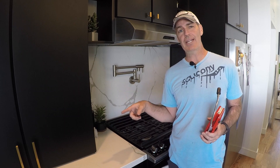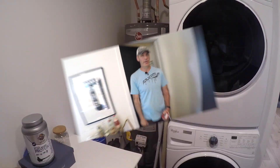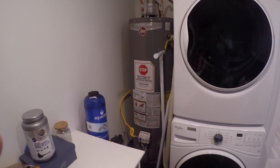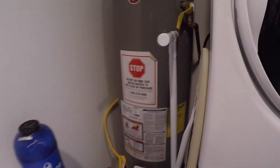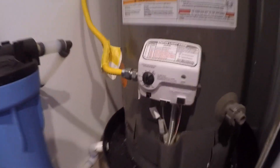This is the pantry. Anytime we open up this door I can smell gas — it's a faint gas smell but it's definitely there. Once I open the door it goes away because I've introduced air into the pantry. So let's go in and track down the water heater. Here's the water heater. There are two connections, one in the front and one in the back. I'm going to zoom in and show you that front connection, and then I'll struggle a little to get to the back. That's the connection that's in the wall. I'm hoping it's the front, but as most projects go, I'm sure it's the one in the back.